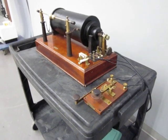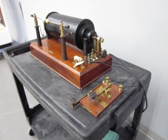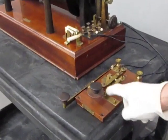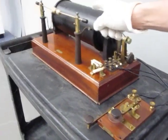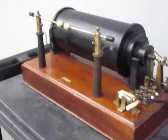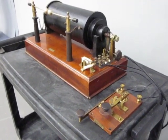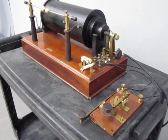This is a Marconi spark gap transmitter from the early days of radio. The way this works essentially is that it's a big step-up transformer, and the telegraph key is the switch that turned it on and off. So when you close the contact with the telegraph key, a spark jumps across the gap between these two electrodes over here. This would also be hooked up to an antenna, so that would be spewing out radio waves across a broad spectrum of the radio frequency.